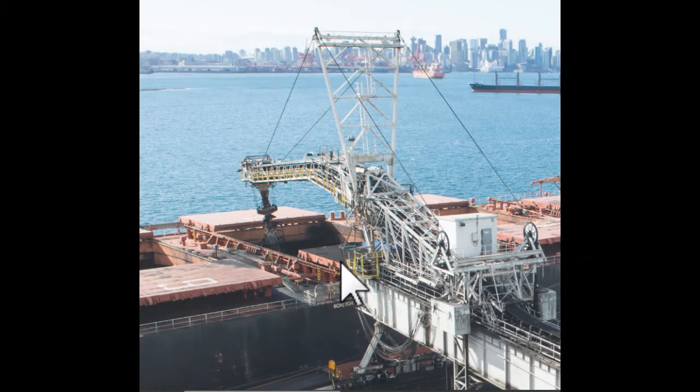When the shiploader enters a new hatch at a very high tide, be sure the boom high light is not on. You must boom down till the light goes off if possible, or the conveyors will not start. Also in this situation, be sure that the boom of the shiploaders never comes down on the hatch covers.